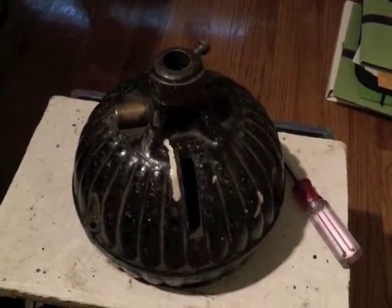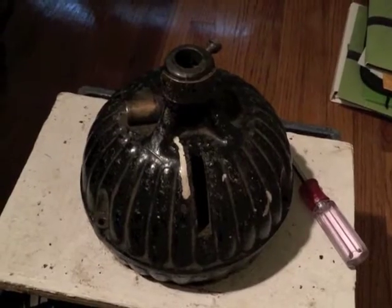I'm going to open it up in a second and we'll see. Lundell motors were a little different because they slanted their motor poles, and the donut field coil that wrapped around the motor poles was slanted on its side relative to the armature. So I'll go ahead and open it up and we'll see what we've got.